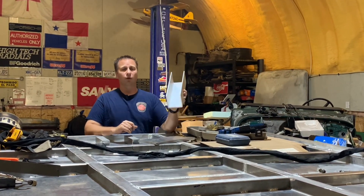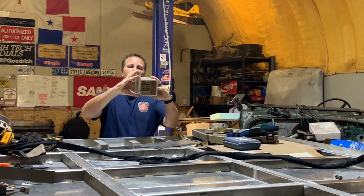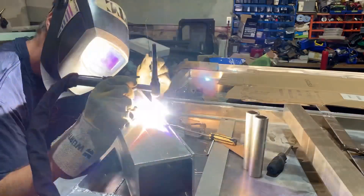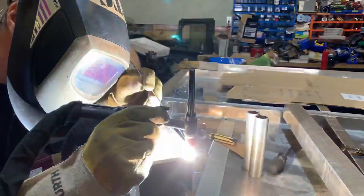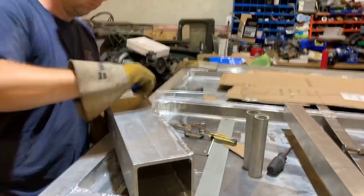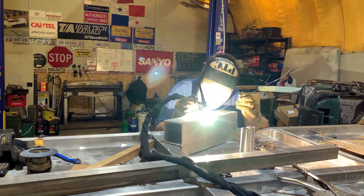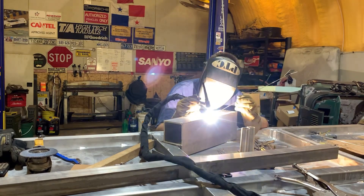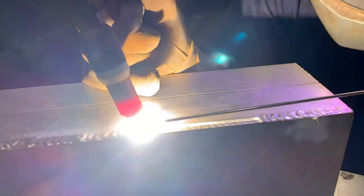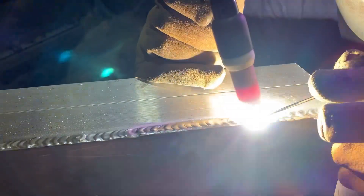That's where this piece of four-inch channel and plate come together. I need to make this into one piece. The reason for making these mounts out of this large channel is to help give a wider stance to the legs, which will not only help in stability but also give me a bit more maneuvering while driving the truck under the camper. I've cut a saw groove along where I'm welding — this is to help get the weld to penetrate deeper into the material and let the weld be more flush with the surface.